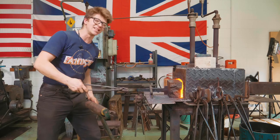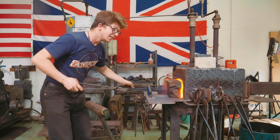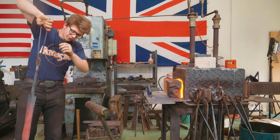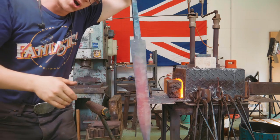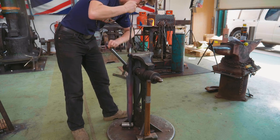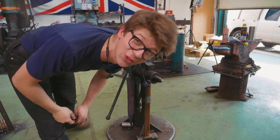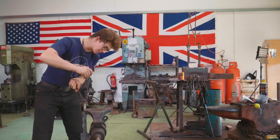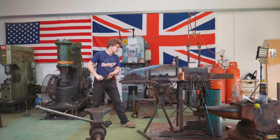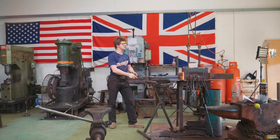Because we have all these studio lights in here, it makes it very difficult to judge the temperature of the work piece. So we've got that magnet there, and I can see if it's magnetic - it's not. This whole piece is non-magnetic but it looks a lot colder than it is. To let this cool, I'm going to simply lock this in the vise until it's all the way cool. We're going to do one more normalizing cycle, and then we're going in for the quench. Time has passed - this has now cooled down to room temperature. It's time for our second normalizing cycle, so into the fire we go. We'll continue painting this back and forth until we get a nice even temperature.